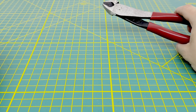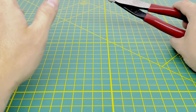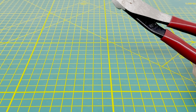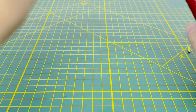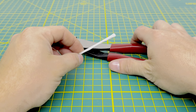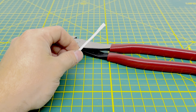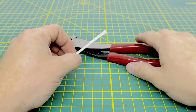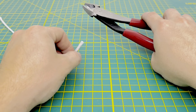That's just something I've noticed. So that was just some 10, 12 or 14 gauge wire. These guys blast through that without any issue. And then we do also have some insulation right here. Typically you find this in some MC cable that has, I believe, 4 or more conductors on the inside of it. And this can sometimes be a little bit challenging to cut.